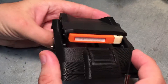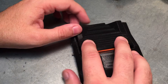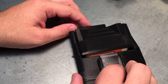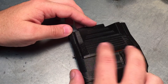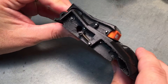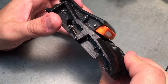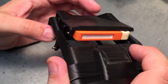A couple of changes from the first prototype. The holotape had an issue closing, which it no longer has — it closes with a nice snap. Unfortunately, I now have an issue opening. One thing I did was shorten these little lever arms, and it looks like I may need to extend those back in order to get that to open nicely. May also just try to increase the spring strength. A couple of changes to do still.